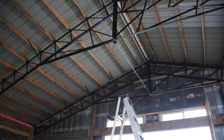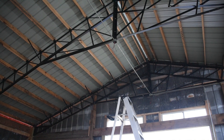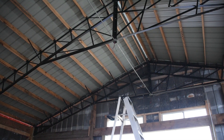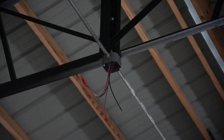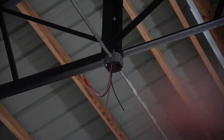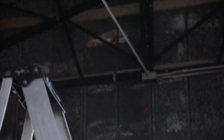After breaking the tip off my fiberglass pull rod, it occurred to me that as cold as it is today and as stiff as this wire is — it being 10 gauge — I might be able to just tape the end of it and push it through the conduit. And lo and behold, it worked great. So I'm glad my tip broke. I'll show you the tip of the conduit and you can see the red tape on it. I was able to just tape the end of it and it pushed right through the conduit. With the natural curve of the wire, when it got to the other end, it pushed out the box.